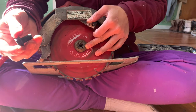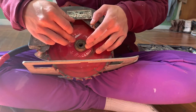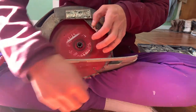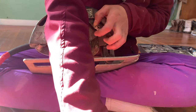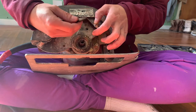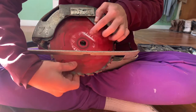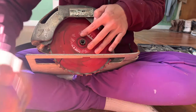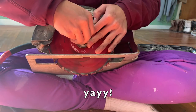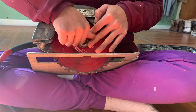Effectively what I've done is change the height, so the stationary part is now sitting below my washer. That's why my bolt wasn't doing anything — it was trying to grip onto the washer but was really just gripping the centerpiece. Now with that in mind, even as it wears out in the future, I'll know what kind of component I'll need to make this work again.